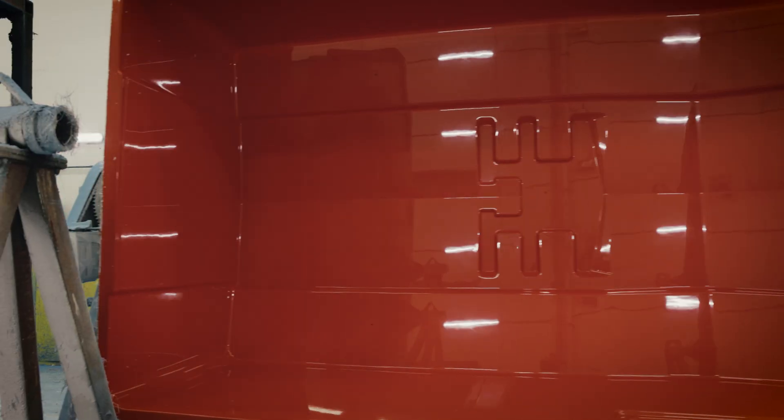The process starts here with our molds. To prepare them we first apply a mold release. We give it several coats of the mold release to make sure that when we're ready to demold the part, it comes quickly and freely right out of the tool.